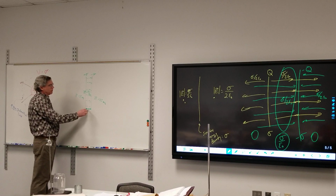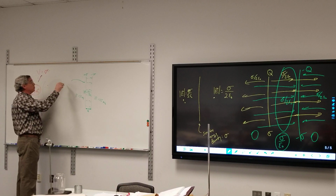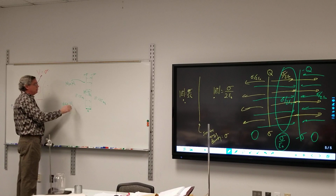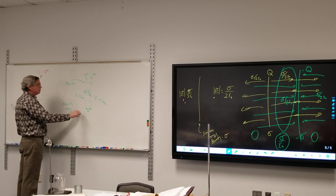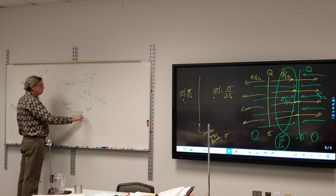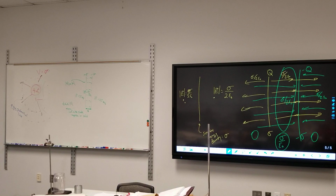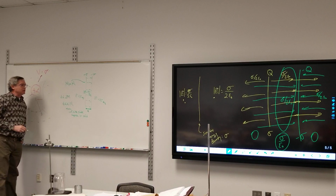Generally, if you look at this distance here, I'll label it D. This has a plate, let's make it a square plate, so M by M size plate. If D is much less than M, then the infinite plate approximation is valid. Mathematically, they'll give you a situation, and you're thinking, wait a second, what does it mean, much less than? Typically, the 10% rule. If D is less than 10% of one of those dimensions, then you're probably safe.